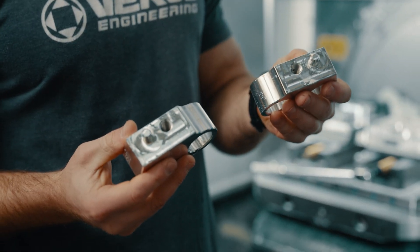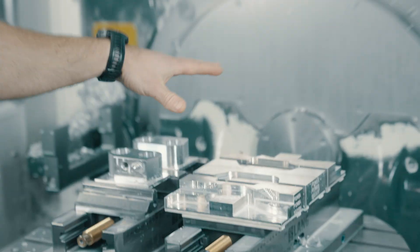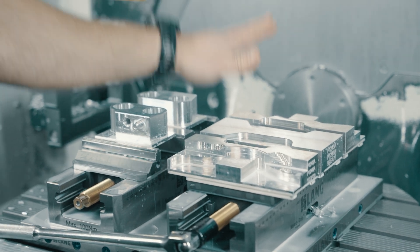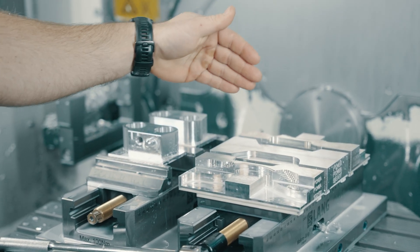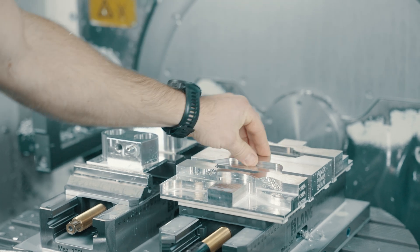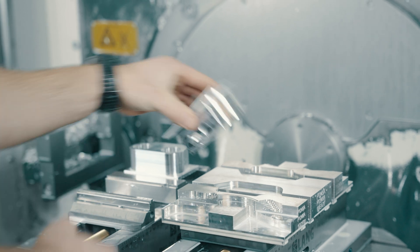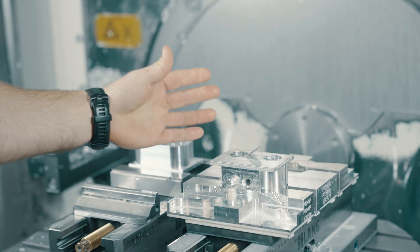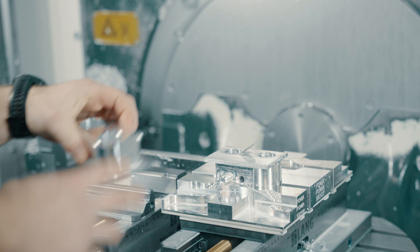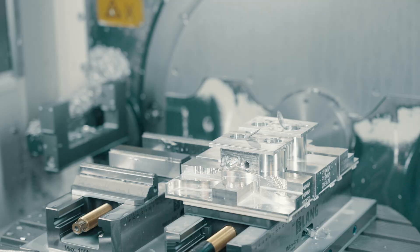We got a left and a right-hand side on these bushing holders. And what I was talking about as far as the fixture design — we actually have a front vise jaw, soft jaw, a rear vise jaw, and then a center jaw. Basically this captures the op one extremely specifically and repeatably so that we can produce them with high tolerance.